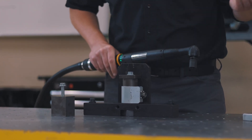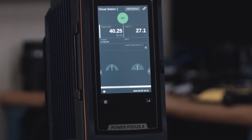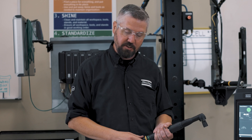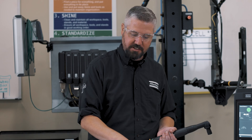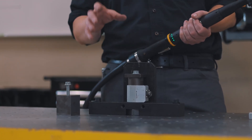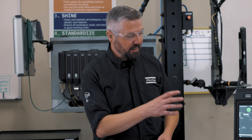There we got 27 degrees — about half of the angle. The reason being is that this bolt is much shorter than the other one; there's less elastic stretch happening in the fastener. So if you were paying attention to the angle, you could actually notice that something changed with the parts that may not have been as visually noticeable as a long and short bolt, but you can have some influence on the quality by keeping an eye on the tightening angle.